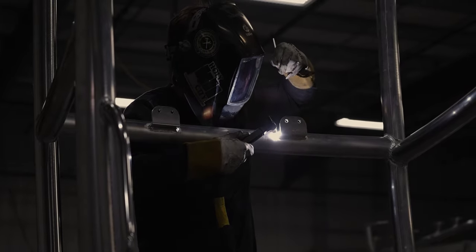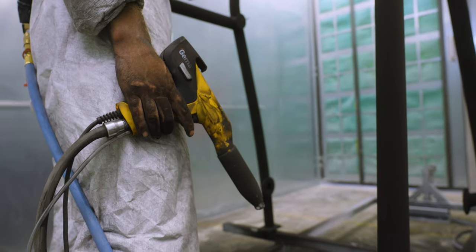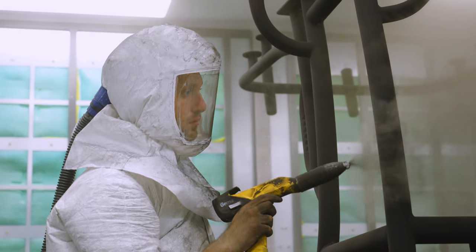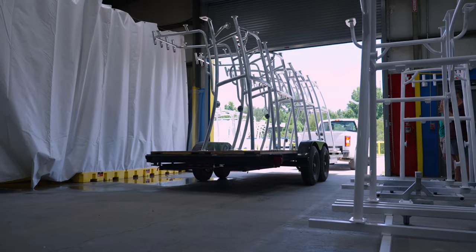Once satisfied with the fitment, they start tack-welding the parts together to secure the pieces and ensure the shape. Next, full-penetration welds are completed on all of the seams — this is where the art form of welding comes in. It takes years to master and is very visible in the finished product; it should look like stacked coins on every weld. You've now seen it go from a stack of parts all the way to a completed hardtop frame. This procedure is very similar for all of our metal parts. Now let's take a look at adding the durable powder coating finish — here at Sportsman our powder coating is done in-house.